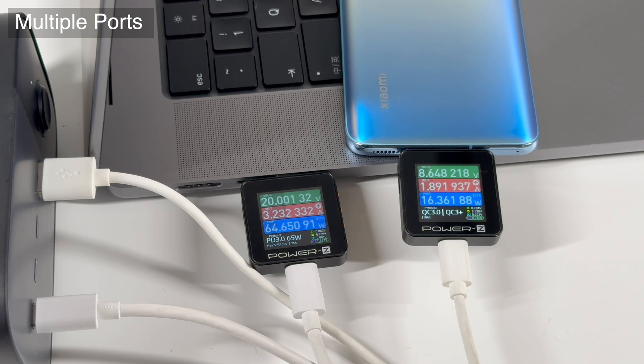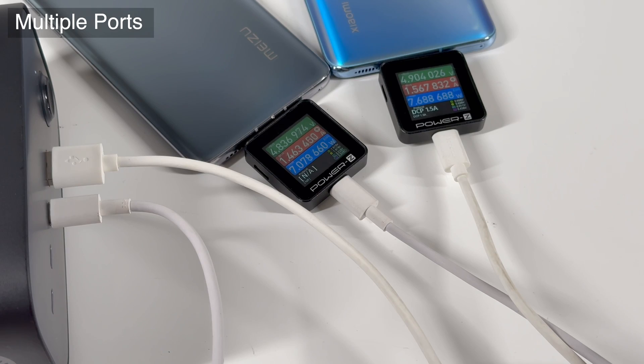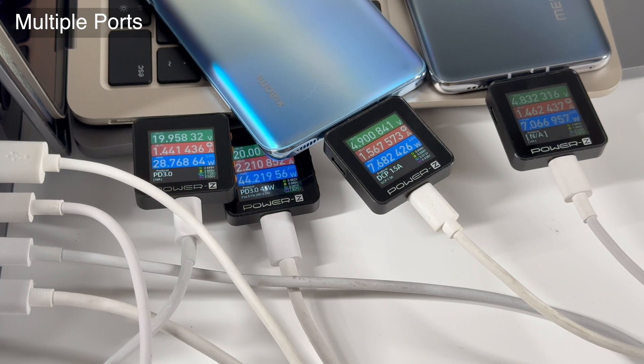So the power drops to 17W. And when charging with USB-C3 and USB-A ports, the 15W can be divided into 7W respectively. Finally, when charging four devices at the same time, the total upper power is close to 90W. The USB-A and USB-C3 ports are about 7W each, and the USB-C1 and C2 ports are around 45W and 30W respectively.